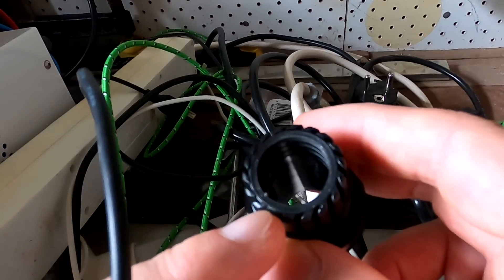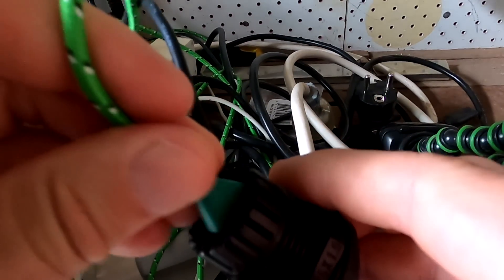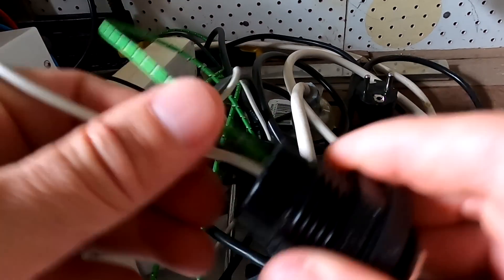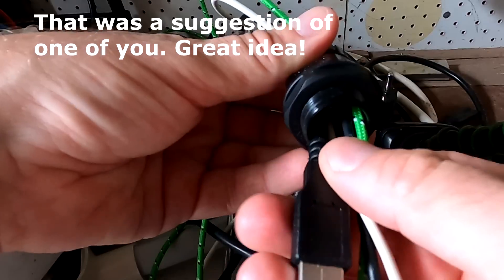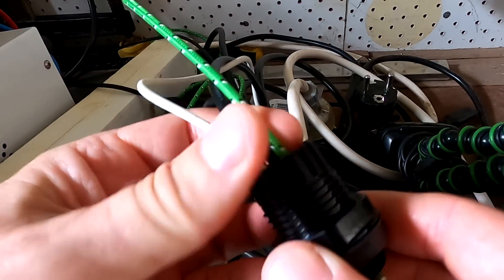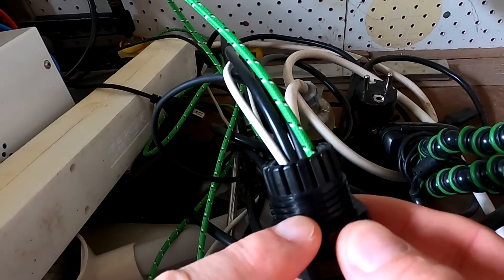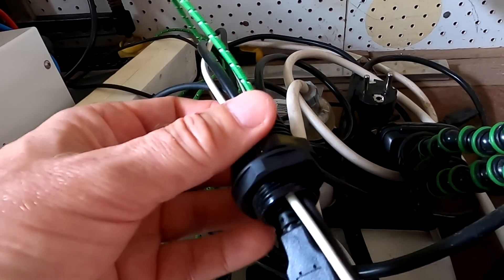These PG-25 glands are suitable for USB connections — one, two, that's a large one, three, and even a fourth one — maybe even a fifth. We can feed multiple cables through one gland, then put the foam in, tighten the nut and it's all locked. So if I drill four more holes for these larger glands in the data area, we are future-proof forever — never say never.